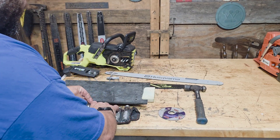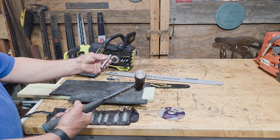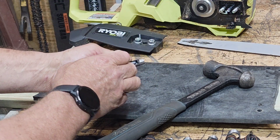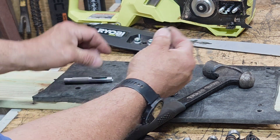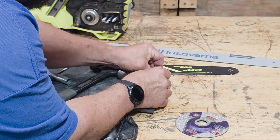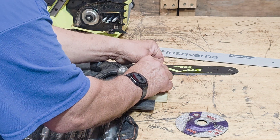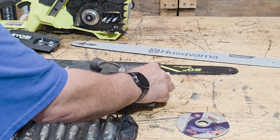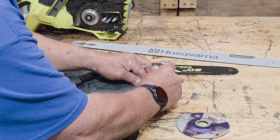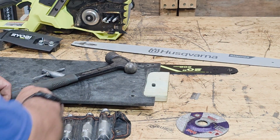Now that the slot is cut, the way that I do that is with pieces of rubber. I have a piece of rubber — I don't even know where I acquired this thing — and I have punches. That piece of rubber is way too thick, so I'm going to cut it thin with a razor blade, and then I'm going to cut a notch out of it so that the oiling is in the correct place. I'll use a smaller punch for that.